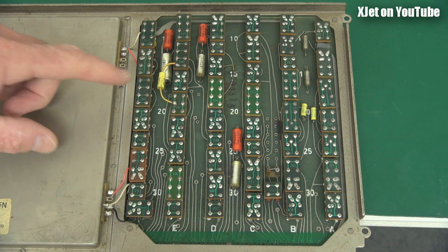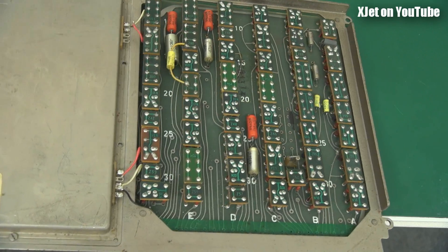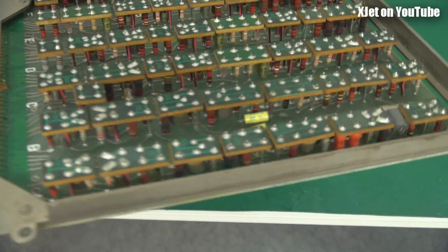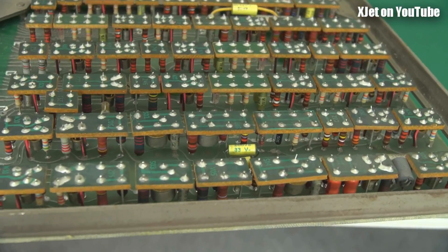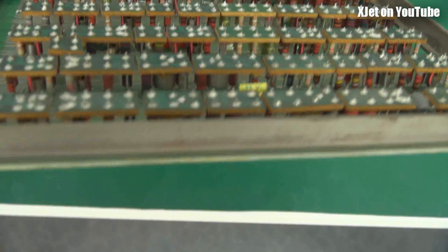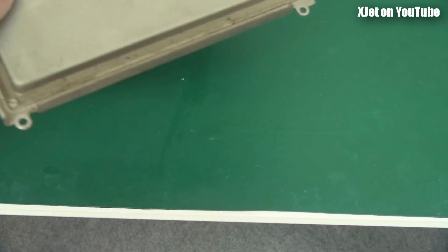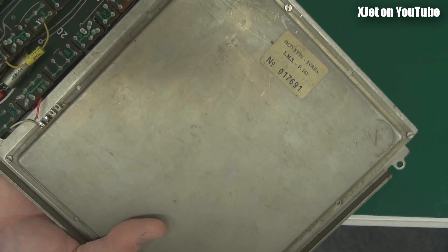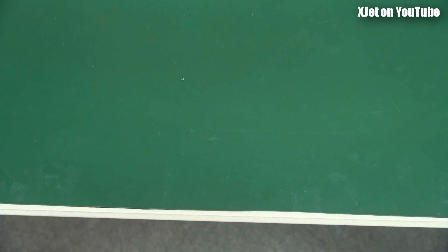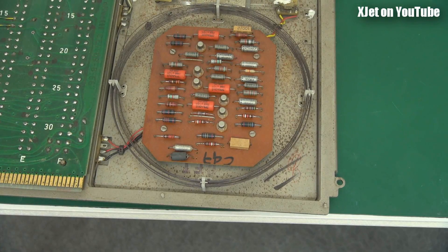And finally, here's some of the support logic for that board on these really crusty old circuit boards. There are no integrated circuits anywhere to be seen. If I tip it up you can see there's just a whole bunch of components hanging from the boards — resistors, and let's see, there's a lot of resistors, a few transistors maybe, some diodes — but there's nothing too flash in there compared to modern technology. This looks like it's out of an Olivetti — Olivetti made a lot of quite sophisticated calculators early in the digital era. We've got Olivetti 1REA — might pay to look that up — and there's the serial number.